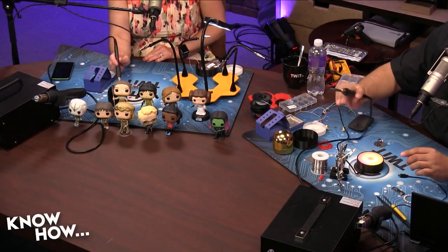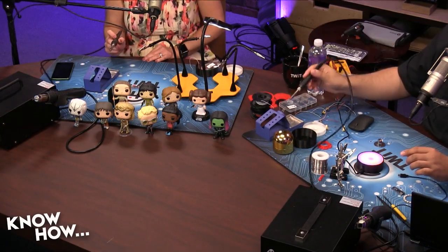Now, you've done a little bit of soldering before, but I just remind you that you always want to apply the solder to the joint, not to the iron, although you could put a tiny bit on the iron just to sort of prime it. And then every time you're done, you put it into the slag pit, give it a couple of brushes, a couple of pokes, just to get it nice and clean. Got it. Cool? All right.